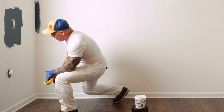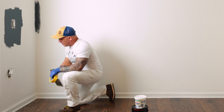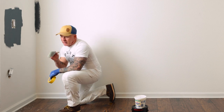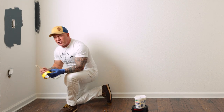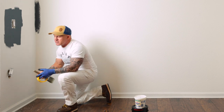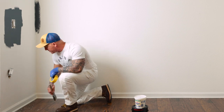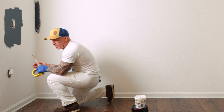So I'm going to start getting ready to do the masking. One of the things you definitely want to do is dust your baseboards and vacuum your floor before you do any type of masking. I always keep myself a little battery-operated shop vac to mask and vacuum. If you don't, your tape is not going to stick very well because the dust and debris could cause your tape to not get a good seal, and you can get paint bleeding underneath your tape on your floor. So I'm going to begin masking — I did a lot of scraping, so I'm going to vacuum first, then dust with my duster brush.